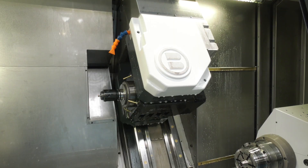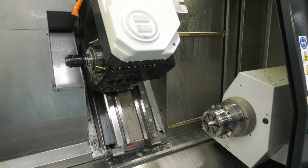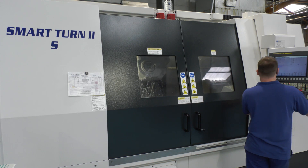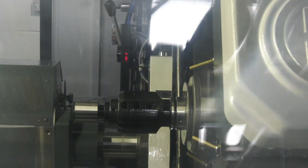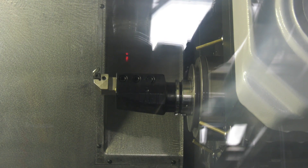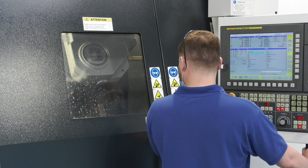And you can do that with this machine because you've got two really beefy spindles. You've got a very powerful milling head as well with a B axis — a very versatile machine. I mean the actual machine itself is huge. When it first came in we were all gobsmacked how big it was when you look at it on paper. But the versatility with the machine, the milling heads — it is a milling machine really. So where we gain on some of the other operations is the torque, the power on the milling. And you've also got 40 tools in the back which allows you to really not have to continually change tooling in and out, or you can do not just one job but go from job to job.